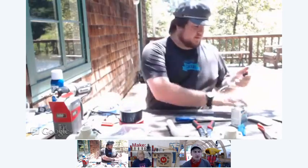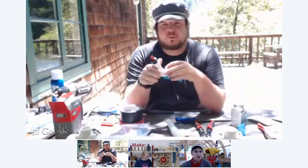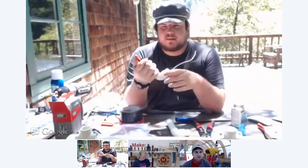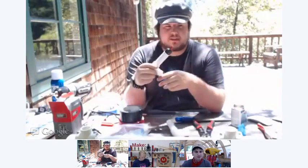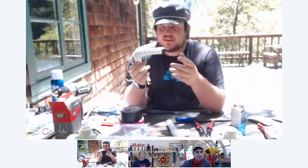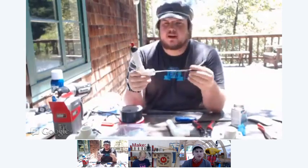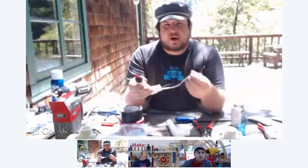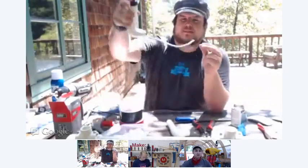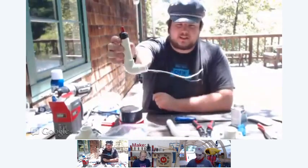Is this the first style of igniter that you thought of, or was this after a couple of trial and errors of figuring out what doesn't work? This was a couple of trial and errors. What did you start out with the first time? Wooden ones that I cut out on a bandsaw. But those had a tendency of breaking, and the screws never held so well, so I eventually evolved into this one, and it works really good. And it's a lot more reliable, right? That's the whole point of the piezoelectric igniter. Right. The problem with the flint ones is they wear out, and you have to replace the flint. So here we have a grip like this with the wire and the igniter, everything like that.